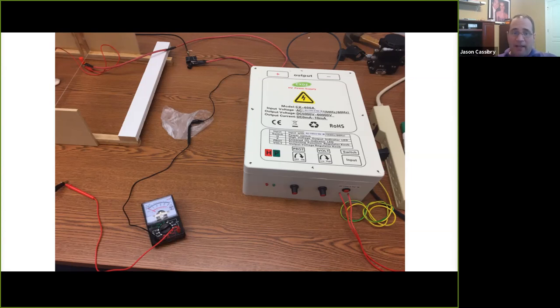But the main thing is it varies with the voltage, or more properly, the electric field squared, like the gradient of the electric field. When you punch in all the numbers, you need really high electric fields to make it work, which is why I think this has not come into mainstream as an application, because it's a small force at the typical voltages that we deal with. For example, a lot of what we use as consumers are things like this 9-volt battery.